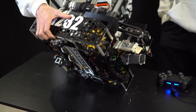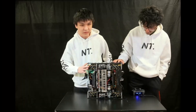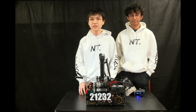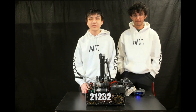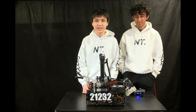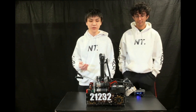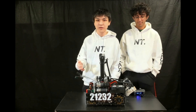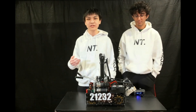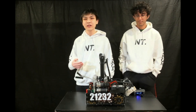Aside from that, we have standard three-wheel odometry, open auto, and it's all just sprung. For our outer plates, we don't have CNCs or laser cutters here, so what we primarily use for custom parts, besides 3D printing, is Send Cut Send. It's pretty standard and I would recommend it to other teams looking to get custom parts, whether it's aluminum, Delrin, or polycarb, especially if they don't have the capabilities to manufacture those parts.